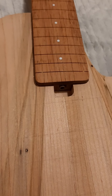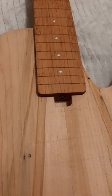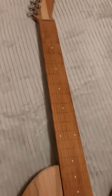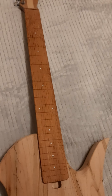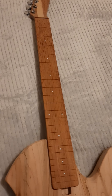Truss rod access is actually from the bottom of the neck. I always prefer to do it that way if I can, simply because I think having a void of empty wood up by the headstock is not necessarily the best. These are simple plastic dot inlays — I got a whole bunch of little plastic rods of different diameters from a hobby store locally. Just drill the hole, stick them in, glue them in. They're really good, seamless pretty much.